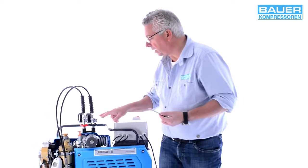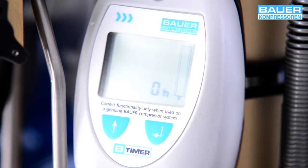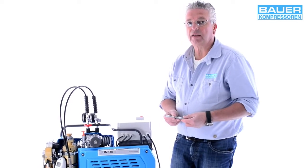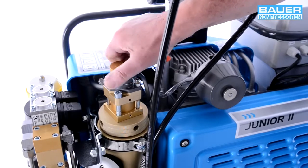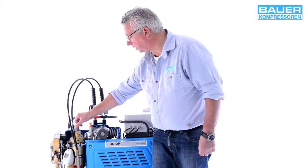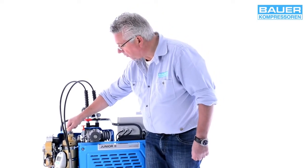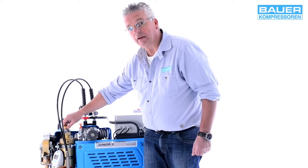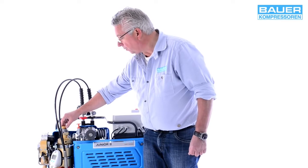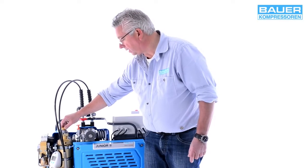In this system, cartridge life is monitored by a B-timer. To activate the display, press enter and the device will show the cartridge status. The operating instructions have more information on the individual menus. Check the safety valve as well — this has a lifting screw device which must always be turned to operation. Turn the screw anti-clockwise to the final position and tighten it to ensure it cannot open during operation. Do not use this safety valve to bleed the triplex filter housing; use the air bleeder to release pressure in the housing.